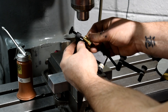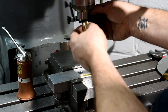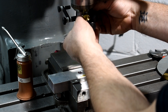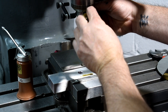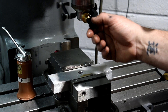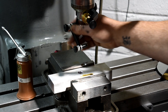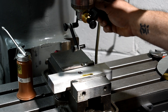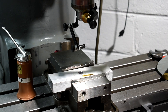I can slide it on here and it fits on the spindle very nicely, then I can just tighten it up. So let me set up the indicator and then we can tram the head in, and then we can talk about making our cut.